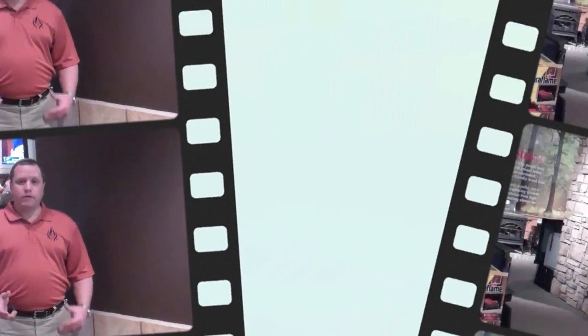Doing this can be really beneficial if you're trying to heat a room relatively quickly. If you're not really interested in sitting around by the fire, you can turn them on, heat the room quickly, and move on. That's what non-vented was designed to do, and it does a good job at it. The biggest reason for the popularity of non-vented isn't the heat at all. It's the fact that they're cheap. By comparison to many other types of fireplaces, they are indeed cheap. It's just a box and some logs, and that's fine. It does what it does. The problem is that it doesn't fit the needs of most consumers.